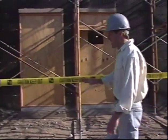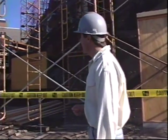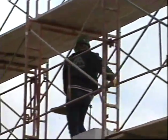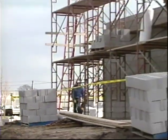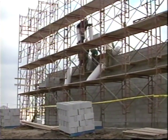It needs a solid foundation, rigid construction, solid walking and working surfaces, safe access, and fall protection. Frame scaffolding may vary somewhat from manufacturer to manufacturer, but there are more similarities than differences, and the essentials of scaffold erection apply to all of them. On the other hand, it can be hazardous to mix scaffold parts from one manufacturer to another. This is particularly critical for tall scaffolding. And any scaffold that's going to bear significant weight should be evaluated by a competent person to make sure it will support four times the maximum load you'll put on it.